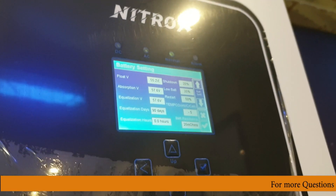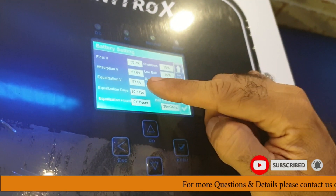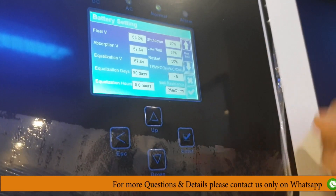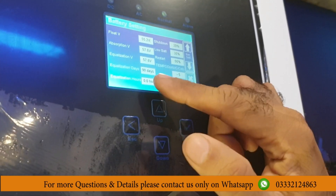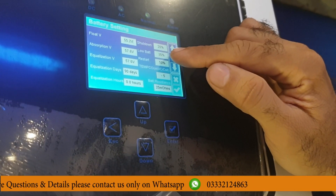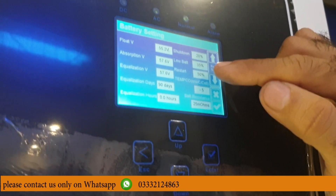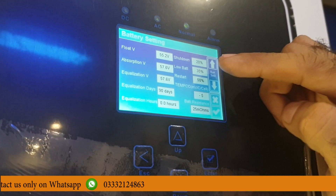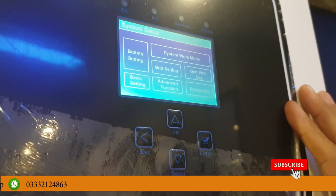I have stored it, so you can now set the charging ampere. You decide how much to charge the battery — 10% charging could be 20 ampere, maximum 30 ampere or 40 ampere. I will set it to 20 ampere. Now we have stored the battery settings. Next, we have to start the grid charge — you can set 30% grid charge and grid signal. You can set your battery to charge from grid at 30%, 40 ampere, or 100% as needed.